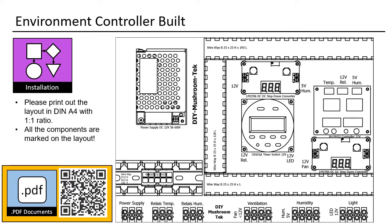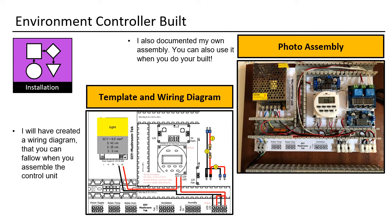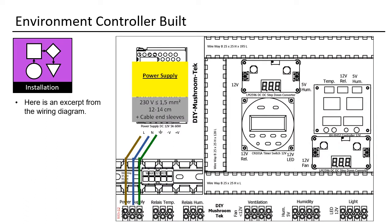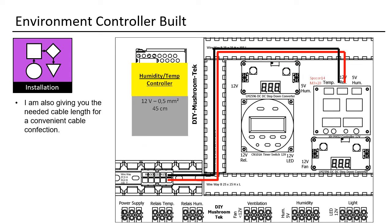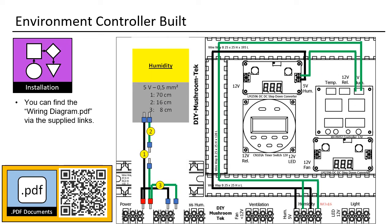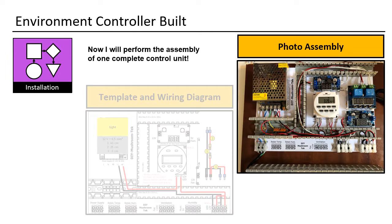You need to print out the template at a 1-to-1 ratio. You will find it where all my PDFs are. I have two assembly documents for you. There is an extra PDF where I show you the wiring as a concept, and there is this video where I show you a photo assembly. Here is an excerpt from the wiring diagram. First step is to connect the power supply. Next step is to connect a WAGO connector to the 12-volt system. Note that I give you the needed length of the cables. Now we will do the photo assembly, step by step.